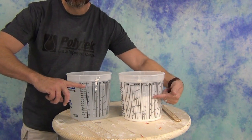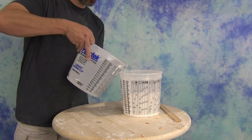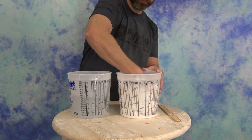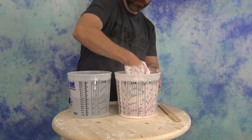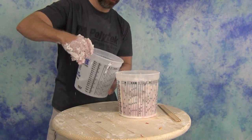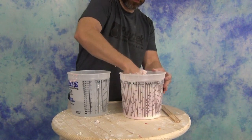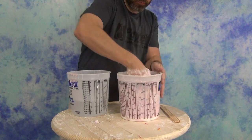Here's the batch we're actually going to use for the hand cast. We've got a little bit over a pound of dry alginate on the right-hand side, and the water on the left, with about a third more water than dry alginate. Just like before, we're always going to add our water into our dry alginate — I like to add it a little at a time, put about half in, stir, then add a little more, stir, and add the rest. You can also use a mechanical mixer like a jiffy mixer on a drill, which is great for mixing, but be sure to follow up with hand mixing to make sure you don't have any pockets of dry powdered alginate in the corners of the bucket.